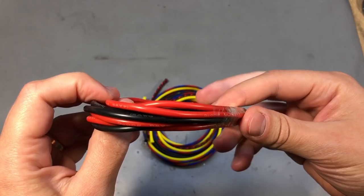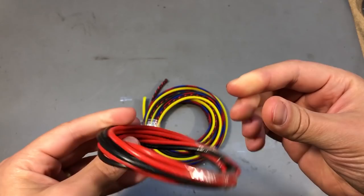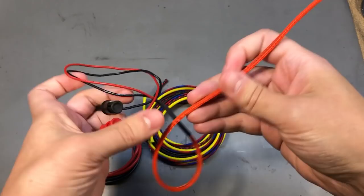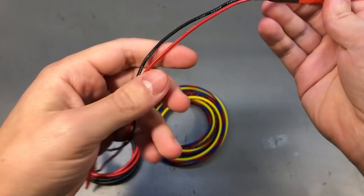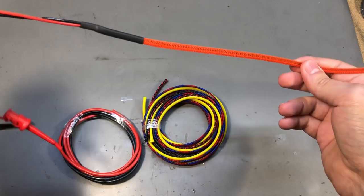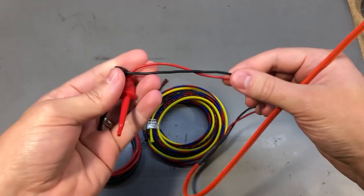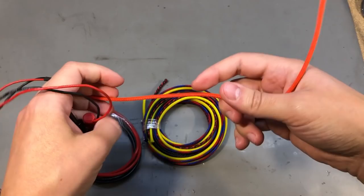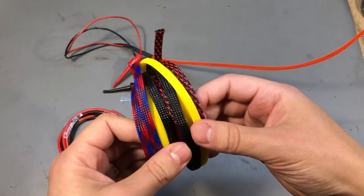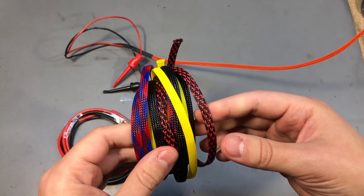Next I ordered some silicone wire — this is 14 AWG red and black so I can build myself another set of 4mm test leads. Lately I've been adding PET expandable braided sleeving to my test leads. You lose the flexibility of being able to split the leads and use them separately, but you gain the advantage of having things tidy on your bench, which I prefer. I got a few different widths and models of this braiding, and they come in a wide variety of colors and sizes.